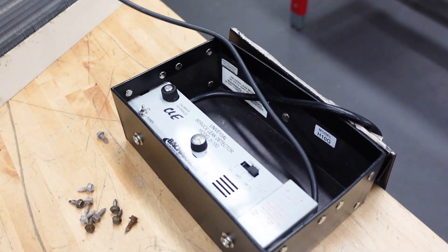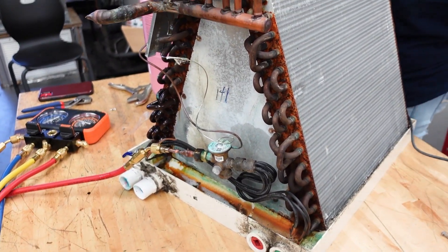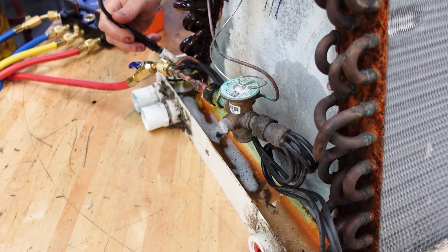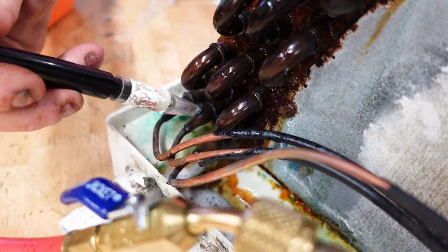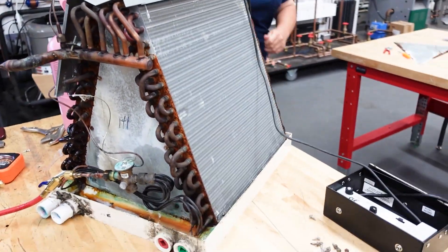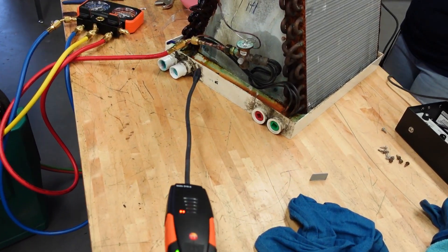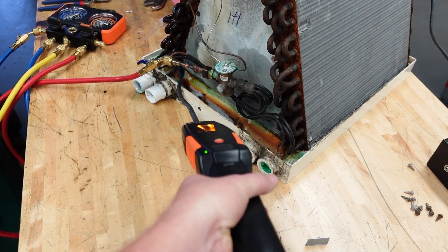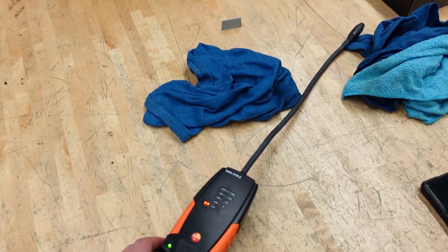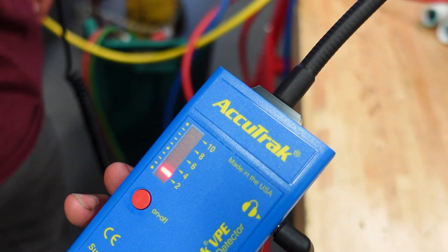It's not real convincing. Cut it on small — check it against the leak references to prove it's working. Definitely working. So this is confirmed to be a pretty darn small leak. Let's adjust it — I'll put it on medium. On medium, we're not picking up much with the H10. Do we try it with the 316? I'm going to try it with the Testo. The 316-3 is picking it up pretty convincingly. This H10 is not doing great, and it is actually picking up with the calibration reference — that's an indication. So you can see it's definitely showing something.